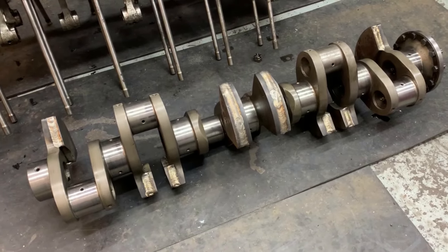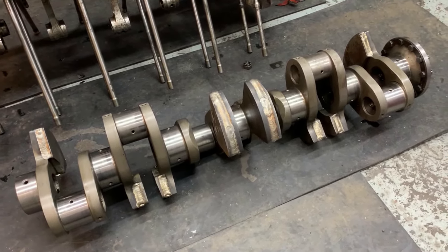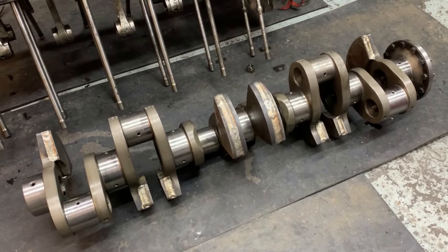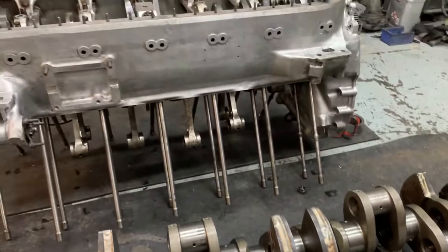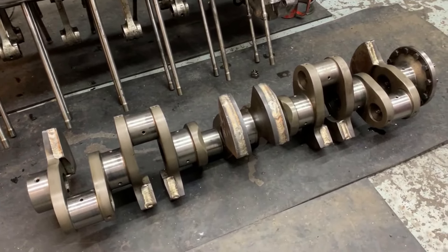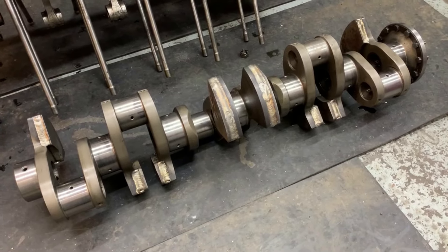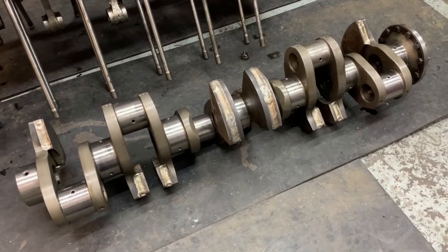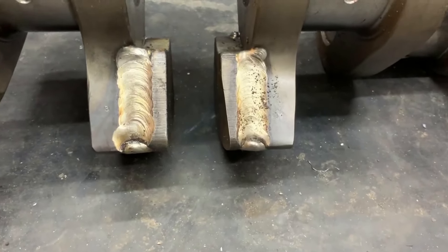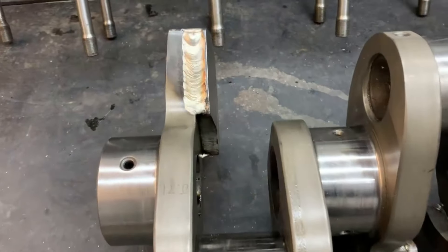It was always my thinking that these counterweighted cranks were used with the Allison connecting rods to maintain balance, but thanks to Mike Barrow for the information — actually it's nothing to do with that, because Allison rods are normally fitted on Merlin crankshafts which are just standard. This has more to do with the very high RPMs in the unlimited hydroplanes. They ran the engines up to about 4,400 RPM, and at those higher speeds the torsional forces and flexibility of the crank and crankcase meant it was pulling the main bearing studs out of the crankcase and probably damaging the bearings. Quite surprisingly, the addition of these counterweights alleviated those problems. They certainly give the crank more inertia, though they wouldn't help the balance — but that's how they got around the problem.